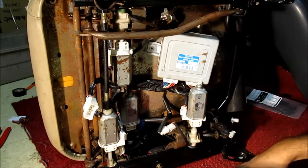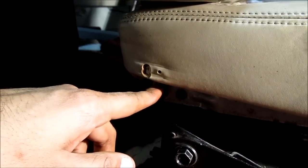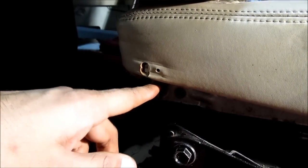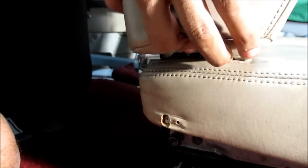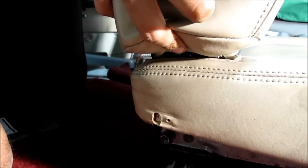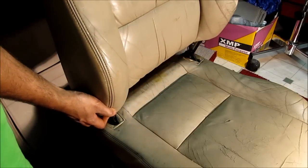I can go ahead and turn the chair right side up and remove the seat back. This is the reclining arm — I'm going to remove this 10mm bolt so the chair will be free to move back and forth. Next, there are two 12mm bolts that the chair pivots on that need to be removed. With all the bolts free, I can lift off the seat back.